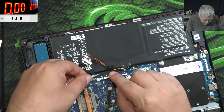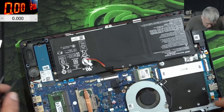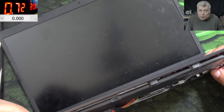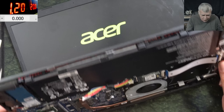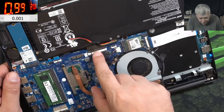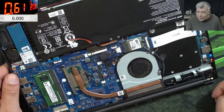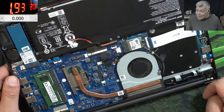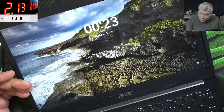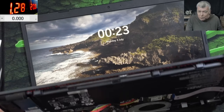How does the laptop start? When you reset the BIOS, usually the laptops start. Depends. Pressing the power button — it's working. No way! So it was actually — was the keyboard not plugged in properly? Because I've seen the line. You can see that this ribbon cable line was a little bit on the back. Can't believe it. Who said easy pizza? Yeah, working fine.